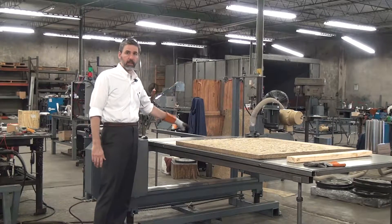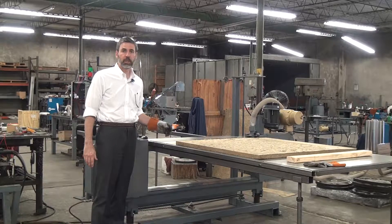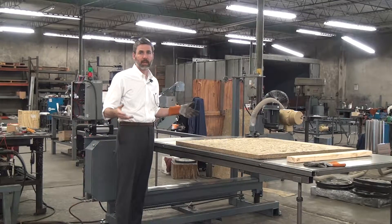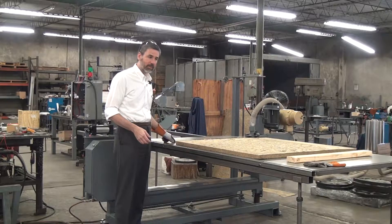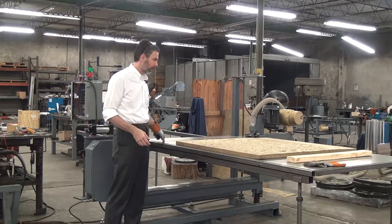This leaves you free a lot of room up here. For example, if you want to cut sheets from a block of material — say a block 48 x 48 x 96 inches — and you want one inch sheets, you can set the blade one inch above the table surface. Cuts come off the bottom and you don't have to move the blade between cuts.